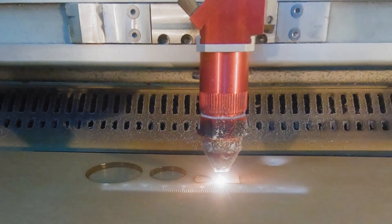A cut goes all the way through the material and an engrave only removes the very top of it. Laser cutting is great at making thin flat parts out of clear or coloured acrylic, plywood or MDF with great dimensional accuracy. But its strengths are also its weaknesses — it can only cut parts in 2D, so if you need a part with 3D features, it is often better to use a 3D printer. Another thing to keep in mind is that laser cutters are precise, but they can't cut thick material. If you want to make a part of thicker plywood or metal, it might be better to make them on a CNC mill.